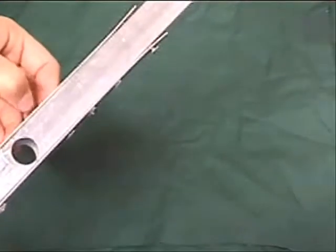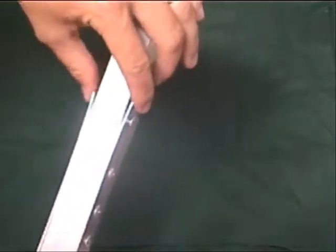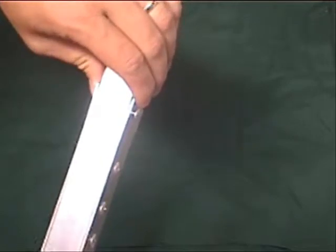Generally, if you can hear any noise between the rivets, that's a sign that it's loose. Also, up here, you can see the two pieces of shims, or the thin pieces of plate, are pulling away, and you can see those have movement in them, so those are loose as well. The loose spots are what's actually going to end up failing on you, because it's going to make it real easy to shear off these rivets. So we'll get those ones pulled out, and we'll re-rivet those in just a moment.